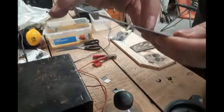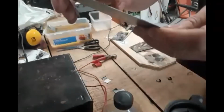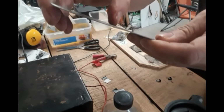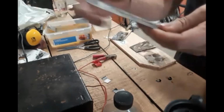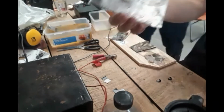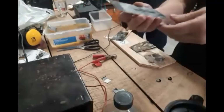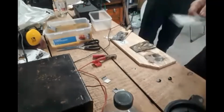That is still quite a small etch. It's only a fraction of a millimetre. You can only just feel the edge of it. So you could have done that on another piece of cloth and done that another few times until you get to the depth that you want. So that is electro etching in two different parts.